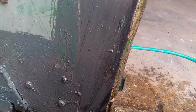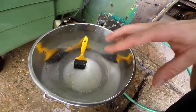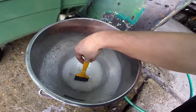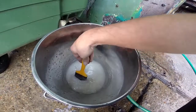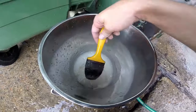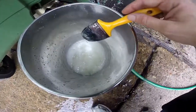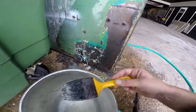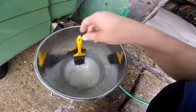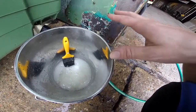I should give that a rinse off. This is the bit that I really agitated — it seems to be a very good paint stripper. I haven't got my gloves on now so I'm not going to touch it. The texture changes with time and it doesn't really want to stick to the brush anymore. It loses that double-cream consistency and just wants to slip off the brush — it kind of forms like a skin. After about half an hour of making this mix, if you apply it, it kind of goes on a bit weird. That tells me you need to mix this and use it, apply it, within half an hour.